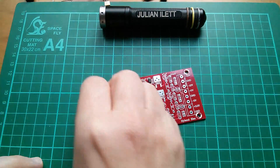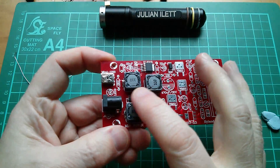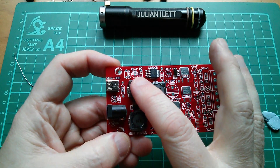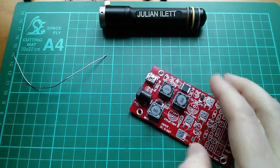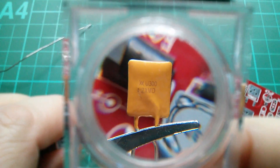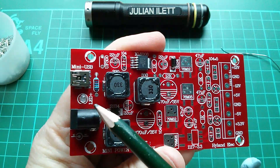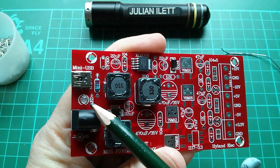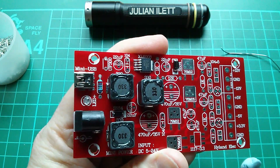I'm not going to get any power into this thing without some input connectors, so I'm going to do those next. There are the two input connectors. Now that polyfuse is a great big huge thing. This device is marked U300, but it's actually a three amp polyfuse. The input LED and a 2k2 resistor — that's going to vary in brightness quite a lot between five volts in and 24 volts in.